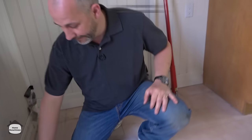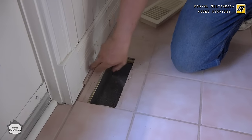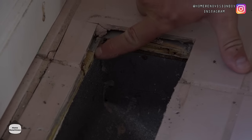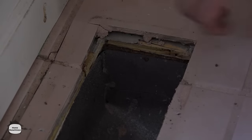When you're doing a new flooring job and you have existing tile, probably 90% of tile installation projects in homes with a wooden subfloor look a lot like this — and this goes for kitchens, bathrooms, laundry rooms, hallways. This home has got ceramic tile and it's not in great shape. You can see there's a plywood layer. This is what we call direct bond — cemented directly to this plywood. If you count the layers, there are four, making this plywood a half inch.